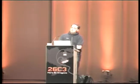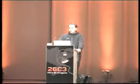And you can try to match up the registers you see with what you see from the CPU. For example, if from the CPU you see a register to configure the serial port, and you change some bit there, and you see on the JTAG chain, the bit chain, an unknown bit changes as well, you might have found the JTAG way to access that functionality. It's interesting because you can map the JTAG functionality to what you already know about the chip. If you already know how to access it from the CPU side, you can figure out how to access it from the JTAG side, and access it also on a system where you don't have control from the CPU side.